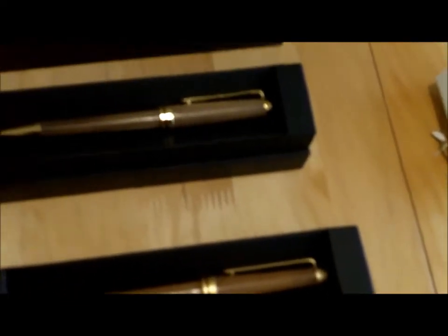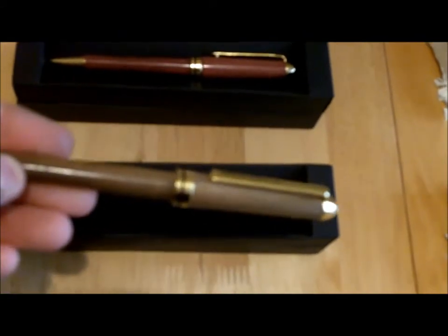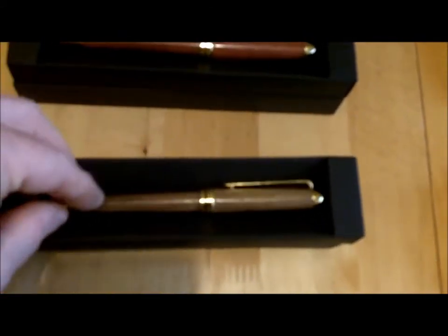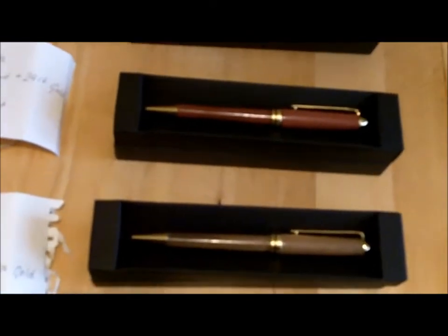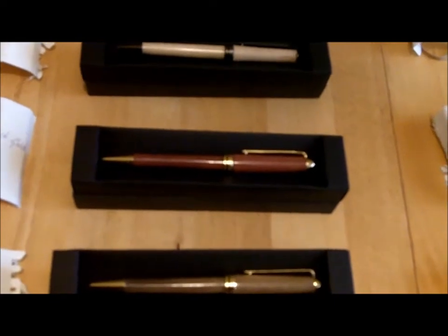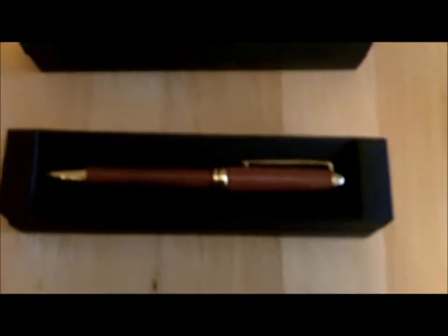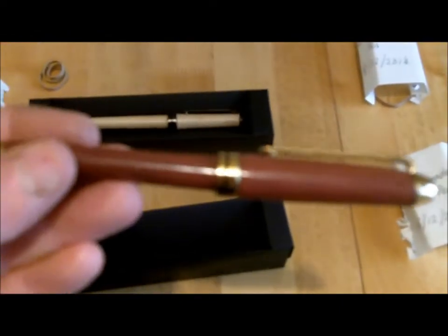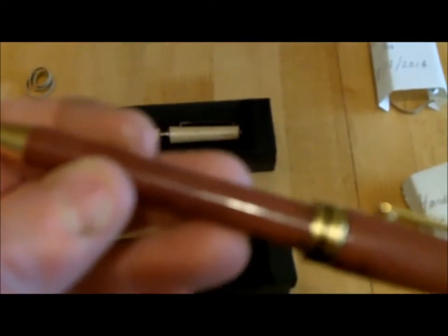Pretty pleased with them so far, I've enjoyed doing it. The actual turning of the pen hasn't been a big drama. The hard thing about pen turning for me is drilling the hole in the center of the blank. So I've got a piece of wood, cut it in half down the middle, and put a V-notch in each side so it holds the blank vertically and square in my drill press vise. They all spin fine — they're good kits.